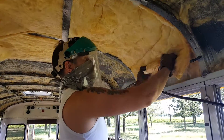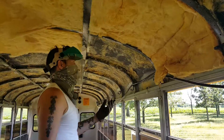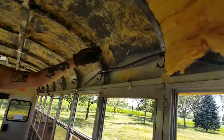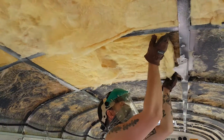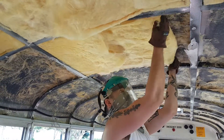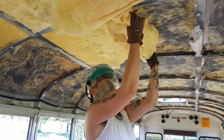So when we were rolling it out, we've been doing it rolling it outward toward you. But we've noticed that these areas — we haven't gone back and cleaned them yet, so it could just be less adhesive holding it in — but we do think there is a possibility that if you tuck it inward and roll it this way instead of the opposite way, it comes out quite a bit cleaner. We're obviously going to have to come back through and scrape some more either way.